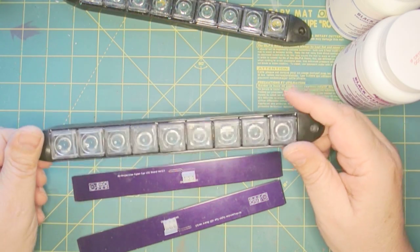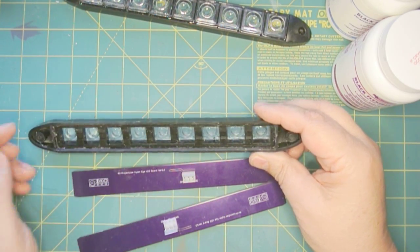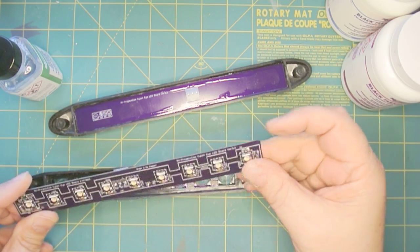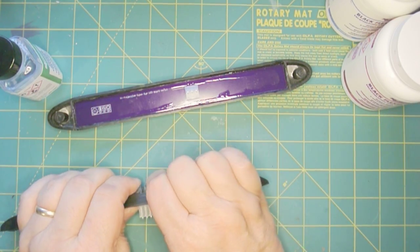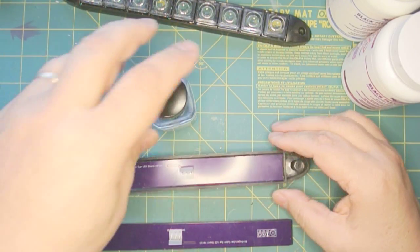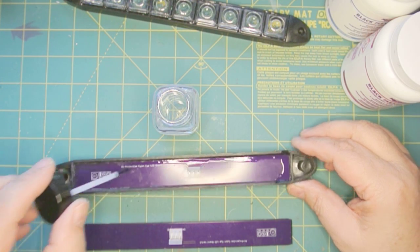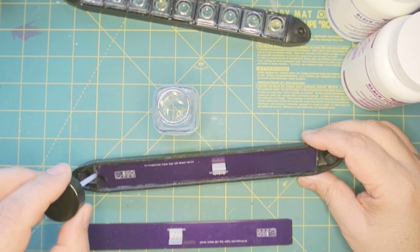If you remember from my original video, when you get these they have a strip in them already that is just white. When you remove the strip, you're not going to get all the flash and all the glue off, but that's okay. When you put these in, they'll go either way — you can put them in this way or that way. It used to be a little harder, but I adjusted the dimensions a little bit and put little notches in the corners, which seemed to really help a lot. You can just put them under one lip and they should just kind of snap in. Then I like to take some conformal coating and run a bead around the outside. This isn't going to really waterproof it that well, but it will prevent the epoxy from leaking down inside the device, because with the epoxy, if there's any kind of a gap at all, it's going to find it. Doing this will just help to keep the epoxy on the outside where it belongs.